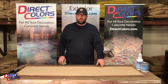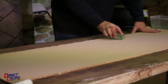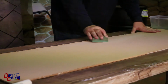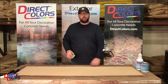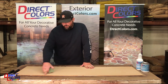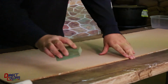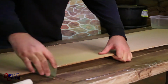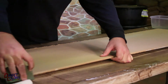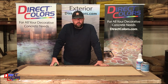We've got a couple of little drips that came off the trowel whenever I finished overlaying this. I'll just show you real quick how easy that sands out. And that's gone. So it sands off really quick. Now, on a side note, if you happen to have overlaid a countertop and you've got some rough edges like this, this will also sand out very easy, and I'll show you that real quick. And that's about how easy it can be to sand your countertops and or your floors.